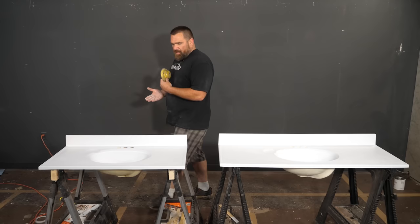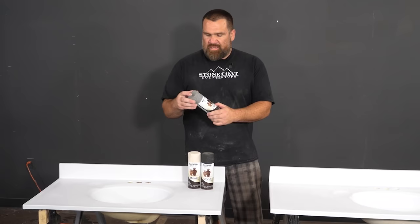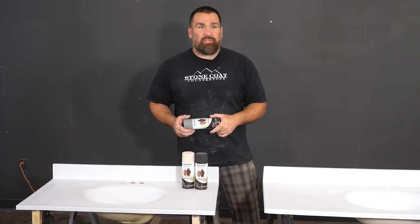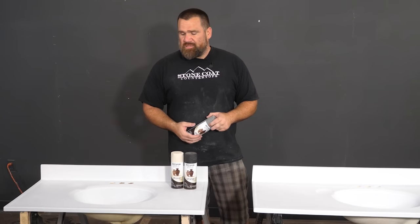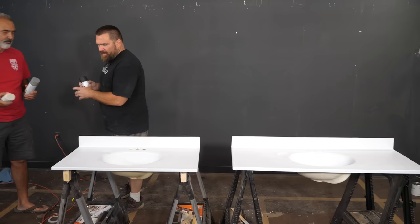The customer went with three stone sprays, which is going to be awesome. It's a 3D textured spray that you lay down and then put clear epoxy over it — gives it some depth. It's a pretty countertop that is beginner level. Anybody could do this part because you're just putting clear epoxy on. When people start mixing in metallics and dyes, they can get intimidated. So if you're new to epoxy, go with the stone spray. It is insanely easy.